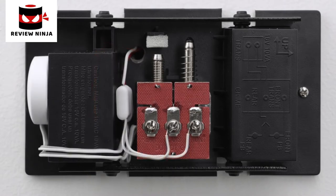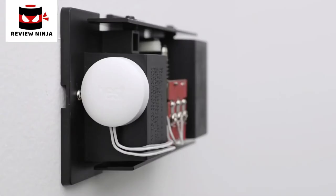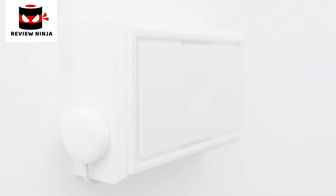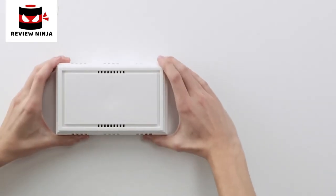Once the wiring is done, find a place to put the chime connector — make sure the connector and wires don't touch the chime or any moving parts, or the chime may not sound right or work at all. It may be easier to attach the connector to the outside of your chime cover. Now replace your chime's cover.